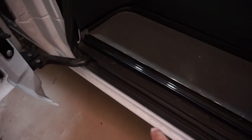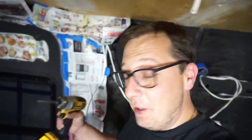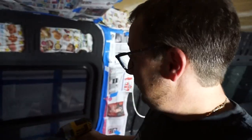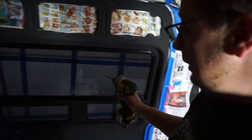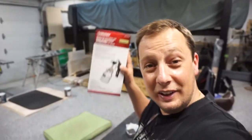Keep in mind I did not take the seal all the way off because it is a solid seal and you'd actually have to remove the door to be able to get it all the way off. So I'm just going to lay it across like that, then we're going to take all these flyers they keep leaving at my front door to make that door look just like this. I'm not going to waste your time with the prep work — it's like the most important part of the job, also the most time-consuming, but I'm sure you get the drift. So the reason why we taped that window in is because this beauty ring, as you can see, sits around there. When we put in our windows I'm going to take that off so that when our final coat goes on it goes underneath that flange, and then we can stick the flange back on and you won't see any seams. Then the inside of here we covered just so we don't get anything on our insulation.